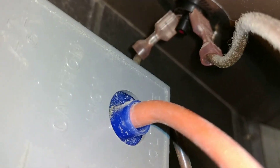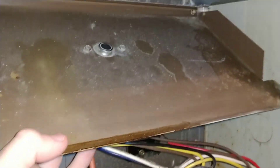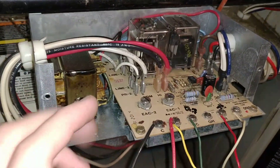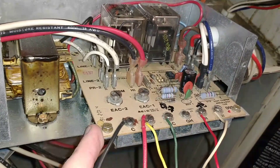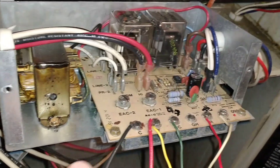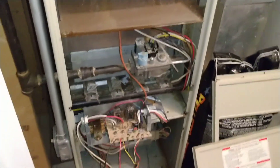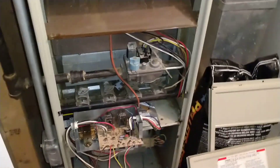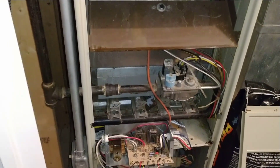The solution was, if you look behind that sensor or switch, there's a reset switch on the back. By simply pressing on that switch, the fan shut down, and I was getting voltage readout once again from this board, and my thermostat was no longer getting the error. This is something I wish I knew previously about the limit circuit in the furnace, and for any of you out there who are having a similar issue and were running heat, I hope this helps.